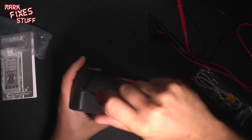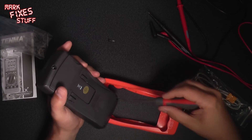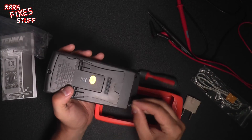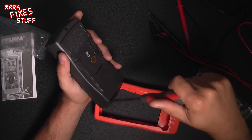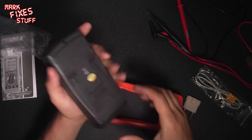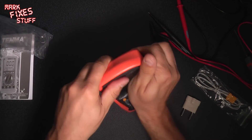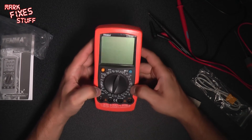How is everyone? This is the joy of kids — they buy you gifts that you have to leave hints around that you want. For my last birthday in October I got an ESR meter, which is pretty cool and has helped me no end. For those of you that don't know, an ESR meter measures the equivalent series resistance of a capacitor, and measuring that is the best way to check whether it's working or not. Because when caps dry out or leak they go resistive, so you can see how many ohms of resistance a capacitor has as opposed to how many it should have. That's why you see things like low ESR capacitors in accurate circuits.